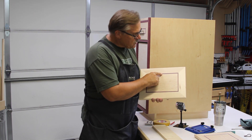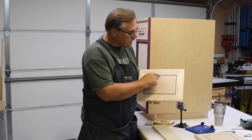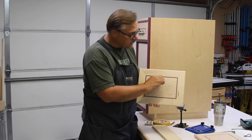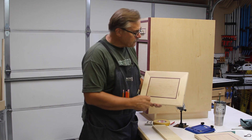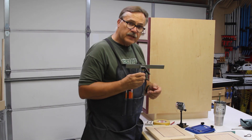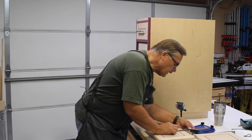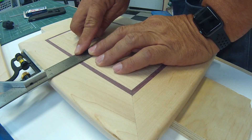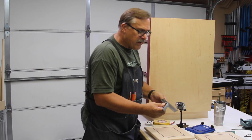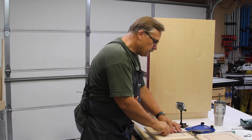In this particular case I measure from here to here and divide that measurement by three. On this particular drawer it's going to be two inches down from the bottom of the purple heart line. The easiest way I found to do that is to use a combination square, adjusting it until my two-inch mark is right at the bottom of that purple heart line in the drawer. Then I tighten it up, so now I have a nice solid guide to get down to my two inches.